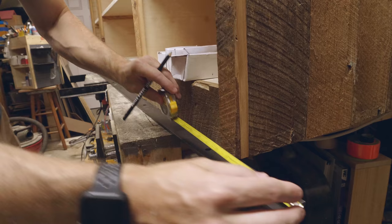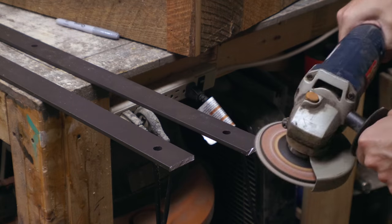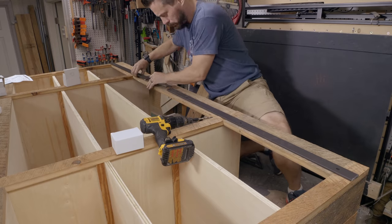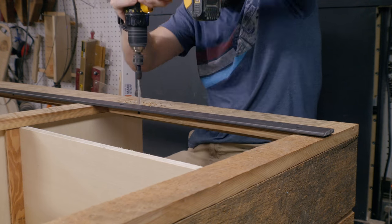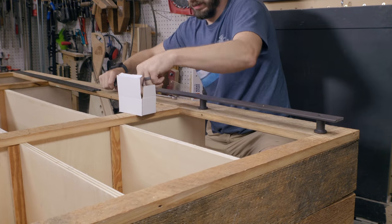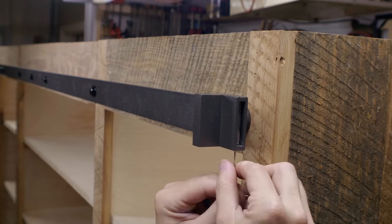I'll have a link in the description for the sliding barn door kit I used — it was really easy to put together. I clamped the two pieces together and used a metal cutting bandsaw to cut them down to length, though you could use a grinder with a cut-off wheel. I sanded them smooth and put some rust preventative on them. I laid the whole piece on its back, laid the track out, measured where it needed to be from the top edge, and made sure it was lined up on the ends. Once in place, I marked all the holes, used a punch to start them, and drilled through the top face frame. The bolts that came with it were too long, so I cut them down with the bandsaw. I put the bolts through the rail, through the standoff, and into the wood, then tightened them with a wrench. The kit also came with end stops that slide on and tighten into place, and they also cover up the cut ends.